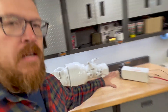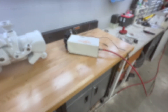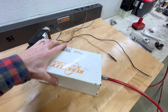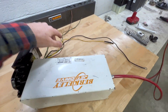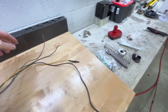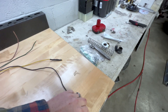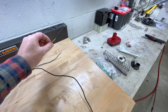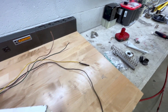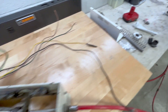I'll do my best to get all this set up and explain it so you have a good understanding of how it works. Here's the main control box for this unit. It's run off of an electric motor and just has four wires off the back of it — two wires, one for each direction of the motor, a ground wire, and a signal for your potentiometer for your trim gauge. We'll go ahead and pop this cover off so you can see inside.